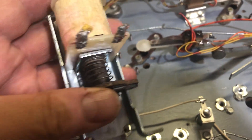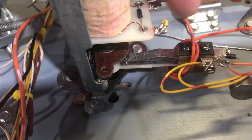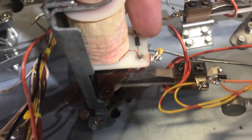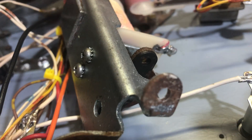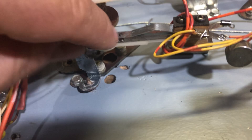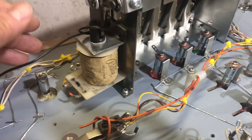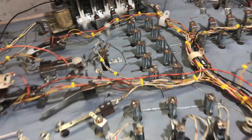I'm going to show you how the coil works — the plunger. In this case this is a pop bumper, so it hooks like this — that's where it hooks up. The wire hooks to the solenoid, and when the switch is compressed right here and makes contact, it sends a signal to the MPU and tells it to activate — okay, do your thing. That's the relationship between all your switches. Any switch that activates a coil — there's switches back here for the drop targets — as they activate it activates the switch, and when they're all closed it sends the computer the note to reset the drop targets.